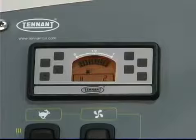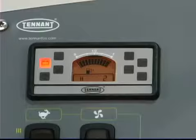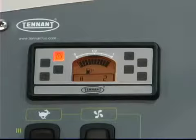Another indicator display is in front of the operator on the left control panel. The charging system indicator comes on when the alternator is not operating within the normal range — if this indicator comes on, stop the machine immediately and correct the problem. The water temperature indicator comes on when the engine coolant is too hot — if this indicator comes on, stop the machine and correct the problem. The fuel level indicator comes on when the fuel level is low — if this indicator comes on, refuel the machine as soon as possible.